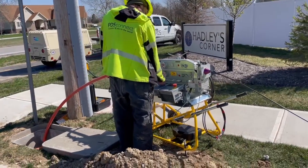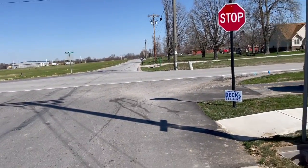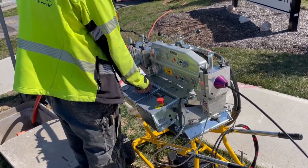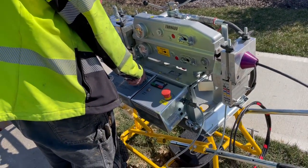I think 3,000 feet took right around 15 minutes. Now we've got the first handhole open to cut the loop out at the far end. What we do is we add a whole bunch of air, open it wide open, and just count — let it count up to the footage that we need, and we shut it off.